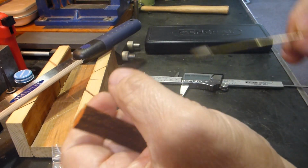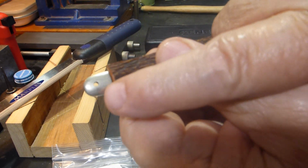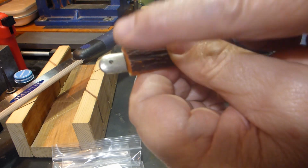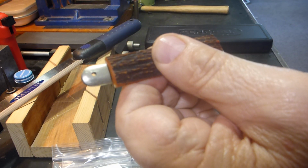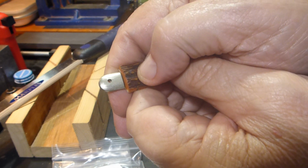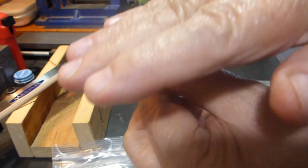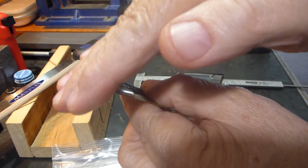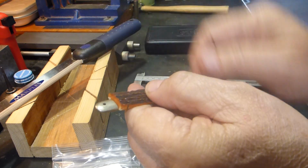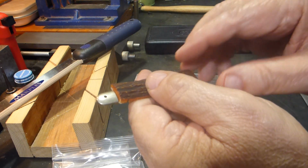The problem is when you go to sand down the end, if you go just past the top of that where it's fit nicely on that angle, you're going to get a gap, and that's never going to get better. It's only going to get worse. And if you have it too far this way, then the opposite is going to happen. It'll fit on the bottom, but you'll have a built-in gap there. So you want to keep that flat and at 90 degrees.